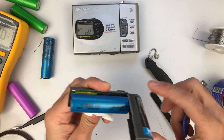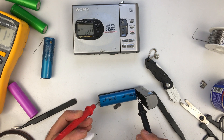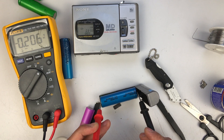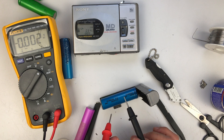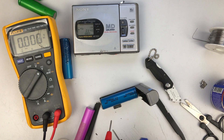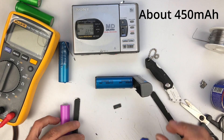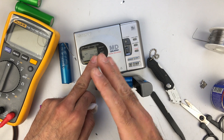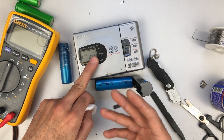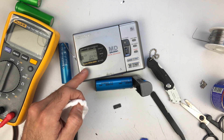As you can see, there's the circuit board and the battery cell. Let's check the voltage of this one — it's 0.2 volts. Because this one is still in perfect shape, I suspect that if I charge it, it will still hold some amount of charge even after all these years — which I'll test and report on later. The player is still running; for 3.6 volts it's at about 40 to 50 percent. The battery I just put in should last for several hours.